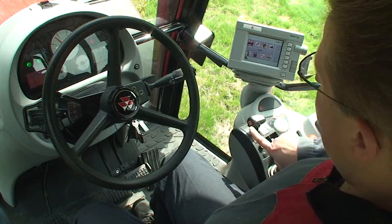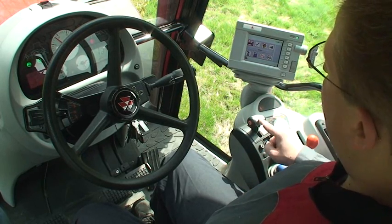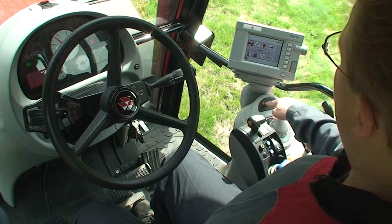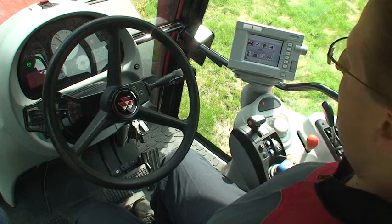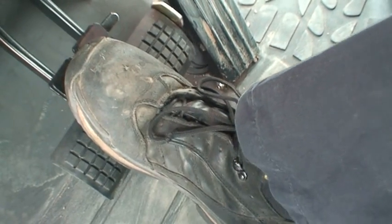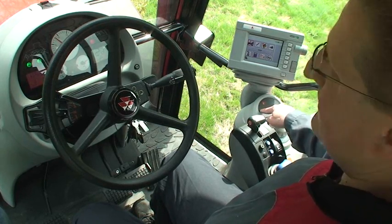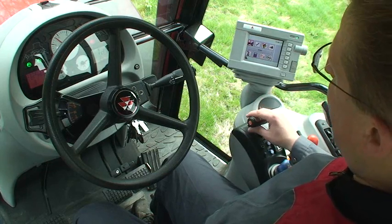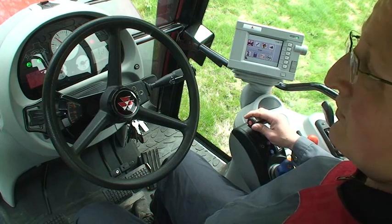You should be mindful when using the button to change the 1, 2, 3, 4 gear ranges, that the clutch actually cycles through a neutral from each of these gear changes. So if you're changing down and you're in a hilly condition, you should apply the brakes, as it is possible for the tractor to freewheel once it's between the gear changes. All in all, this T-bar lever will enable you, the operator, to get the most out of this tractor. A very easy to use control.